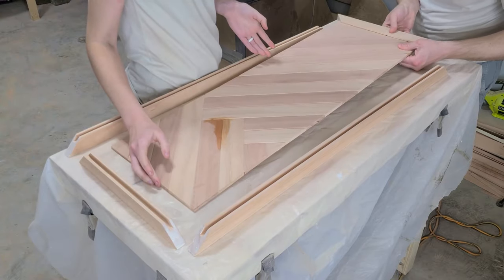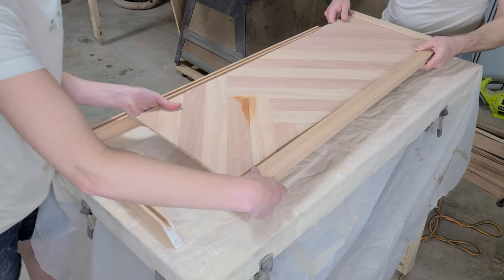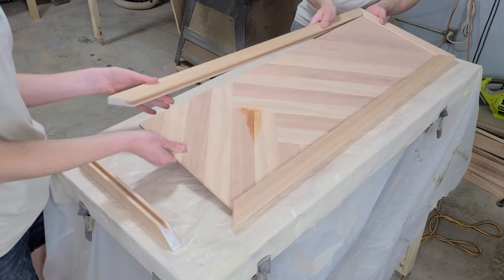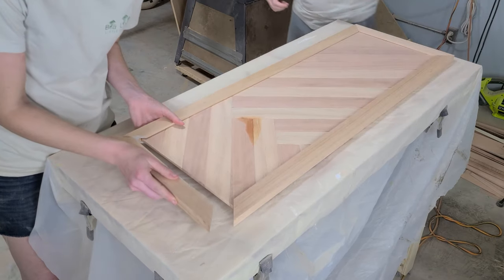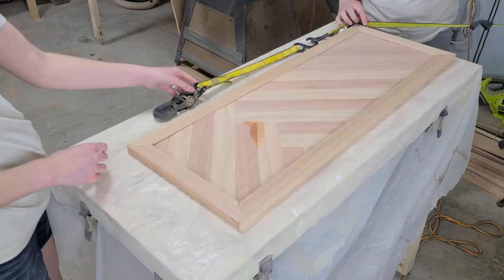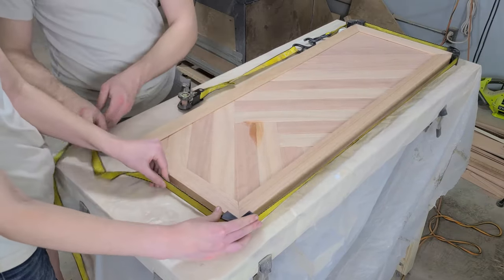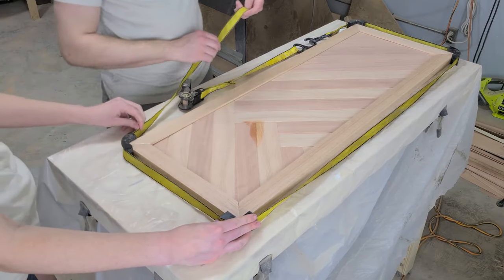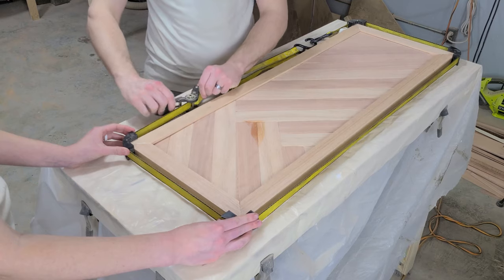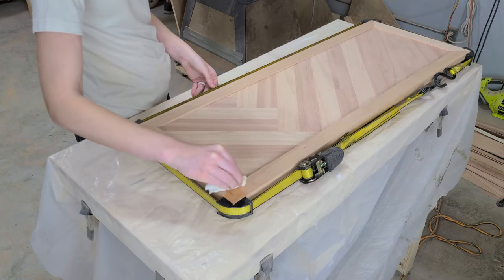We started with a dry fit of each frame to make sure the corners come together. So if anything needs to be trimmed down, now is the time. Everything looks good though, so we went ahead and put the glue on all the edges. Then we press the frames back onto our panel. The panel had a slight bow to it from the glue up, but it was thin enough that it flexed to fit the slot in the frame with a little persuasion. Once all four frame pieces are on, we grab our strap clamp and corner blocks and tighten everything down. We're not going to glue the inner panels since it's bound to move differently than the frame boards - it'll be free to float, and we can always secure it with a trim nail if it rattles. Finally, we clean up any glue squeeze out and then repeat the same process for the second headboard.